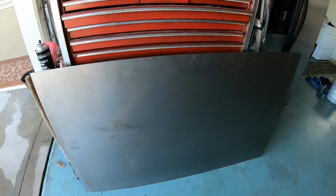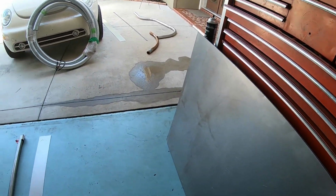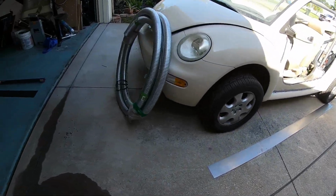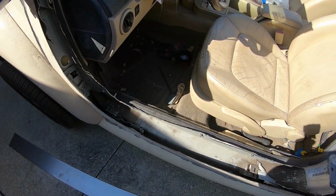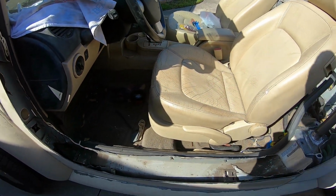I've got a couple nice chunks of sheet metal, out of the same sheet. I bought a whole 4 by 10 foot of sheet metal, 18 gauge, and they sheared it, as I think you have seen on the footage that I know I'm going to edit in there ahead of time. By the way, I also bought this roll of flexible galvanized that I was going to stick in here and form, but it just doesn't address the challenge I'm going to have with the changing geometry, how it comes down to 2.5 inches. I'd have to form it and cut it, and it's just too ambitious for my skill set. So I'm gonna go with the flat cap, and hopefully it'll turn out okay.